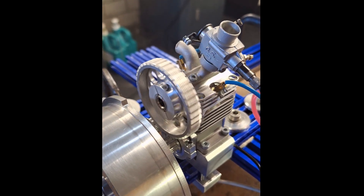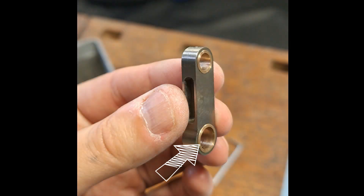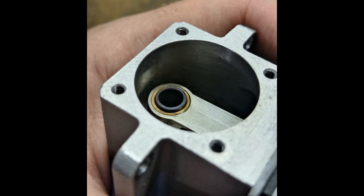The next step is to open the crankcase and see what's broken. You can immediately see the metal chips in the crankcase. These are bronze colored. The only components made of bronze are the connecting rod bearings, which means that one of the two bearings must be defective. We can immediately see that the crank pin is discolored blue — this means that this bearing ran too hot, and we can find the bearing damage here.